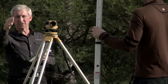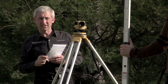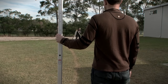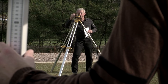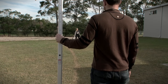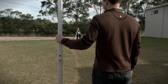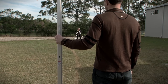Jason's now going to move the staff down to point A, and I'm going to take a reading over the 16 to 17 metres. Now Jason's back on point A, I'm going to take a foresight reading to finalise the readings for the two peg test. The reading is 1.165. I'll just check that reading — 1.165.